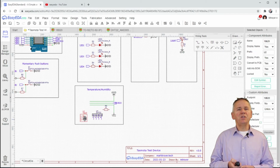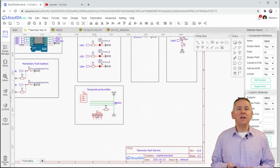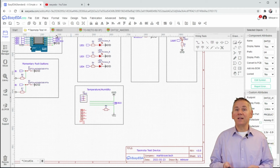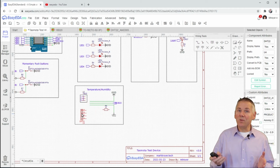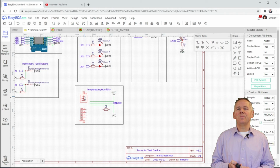My recommendation to beginners of PCB design is to double and triple check the components from the library related to the dimension spacing. While having access to all of these components in a library is great, we cannot always depend on some of the open sourcing of the designs. The measurements are not always what we think they're going to be.